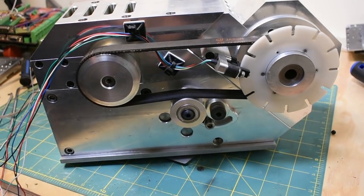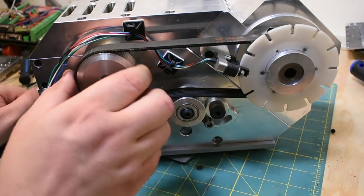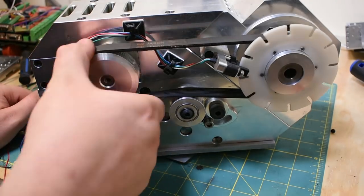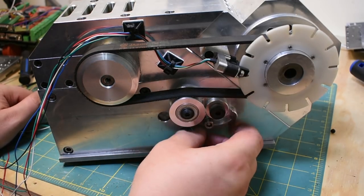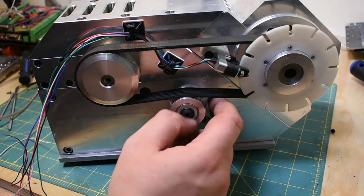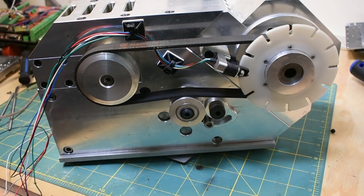All right, I've lowered your view so we can look more straight on at the drive mechanism. So obviously this is a drive pulley coming out of kind of a transmission housing sort of thing. And that's just, you know, J-section pulley is my new favorite. I've got a tensioner here, and it's actually a pivoting tensioner, so I can set different tensions. All in all, I was a little discouraged by how much force is required to properly tension these. I don't think it would be good for motor bearings. I'm actually surprised no one makes a pulley grade motor where it has better bearings in the front.